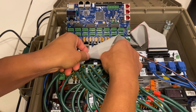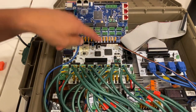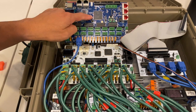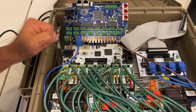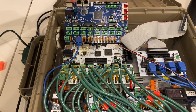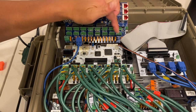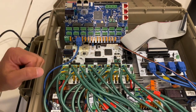I'm going to remove this expansion cable so you can see some other differences. The fan interface on the V3 is here, but on the V4 it's been relocated to the top where the USB port used to be. Looking at the processor, this is an ARM processor — much bigger than the original, with two chips now integrated into a single chip. As far as mounting, the through-holes for screws and offsets appear to be in the exact same locations, and the physical dimensions look identical — so if you wanted to upgrade from a V3 to a V4, you could use the exact same screw positions.